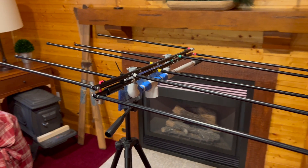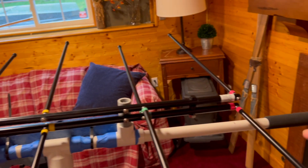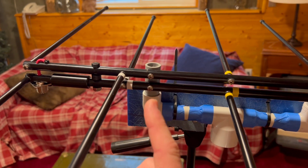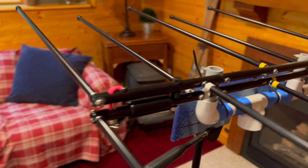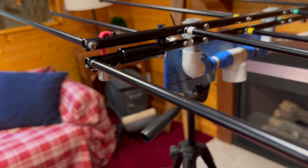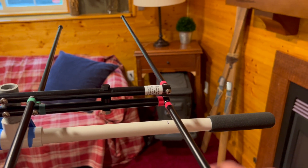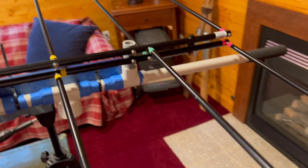All right, you can see the antenna here. These two upper and lower horizontals were pre-assembled. We did have to assemble the radials, but you can see they are color coded on each radial with the corresponding marking on the main beam. The PVC there all came together nicely. Here is the UHF connection. What they say is you need to keep the wire coming down eight inches and loop back — I think it's 20 inches for UHF and like 30 inches for VHF, though they may be switched. I put a little mark at 25, right in between. So we're going to be giving that a shot today checking the SWR.